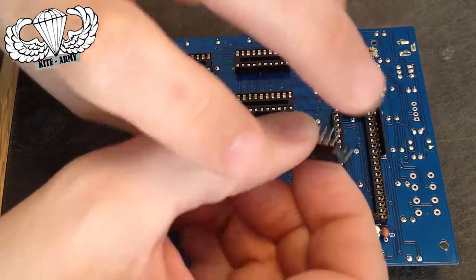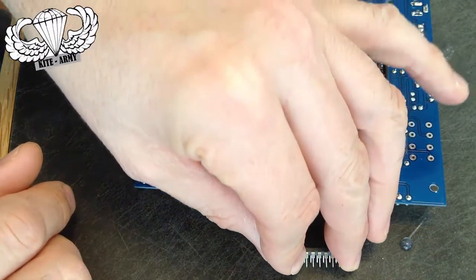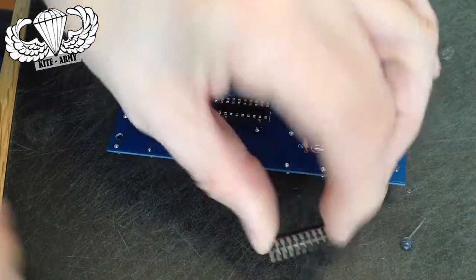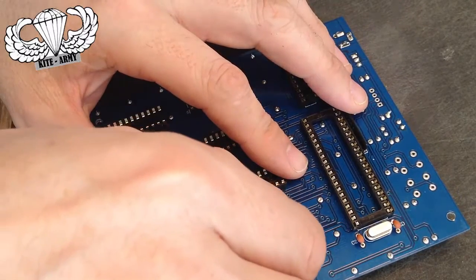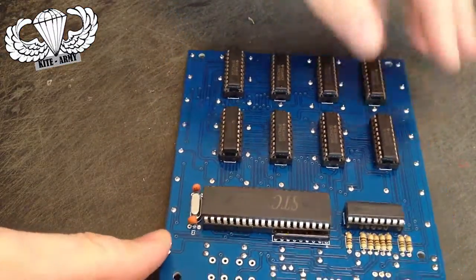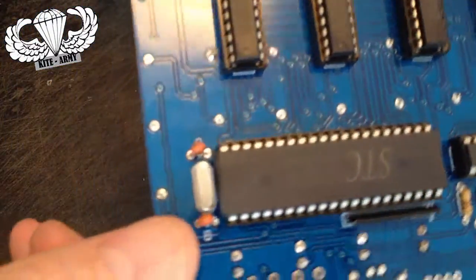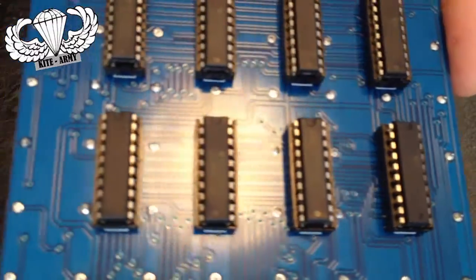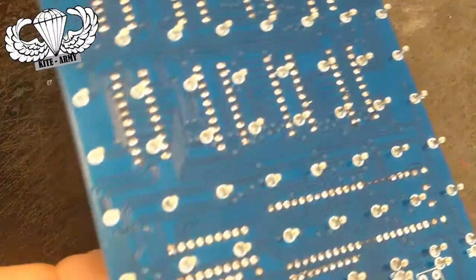Here's one of the chips. When they come they don't fit perfectly into the socket, so you have to put a little pressure on each side of the pins. Just be really careful here — I had one of them twist as I put it into the socket, so install them really gingerly and use even pressure. Here's what the board looks like when it's ready to have the LEDs installed. You can see the large controller chip on the left, and to the further left near my right hand is the crystal and two resistors. Please note the orientation of all the controllers — they're facing down, indicated by that little indentation on the bottom.